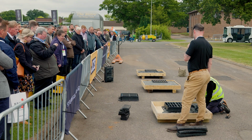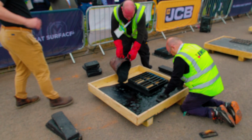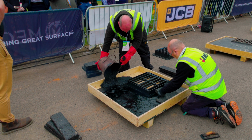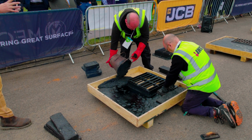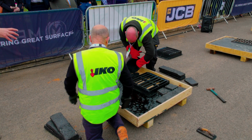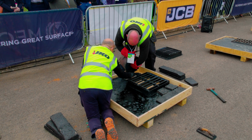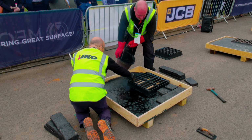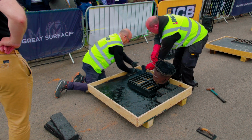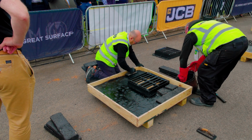You can turn that the other way. So the bricks are put in there basically to be able to cool the material. So what it means is they're going to obviously be trafficked a lot quicker than putting a large volume of hot material into the rebate. So that's the 25 mil layer put in. And then it's just a case of embedding the brick.